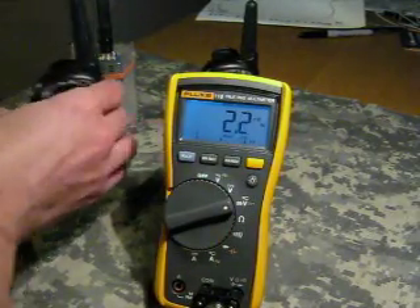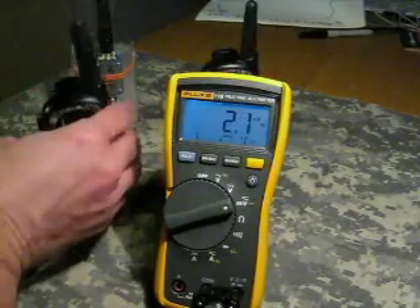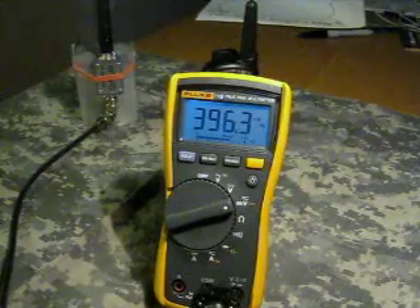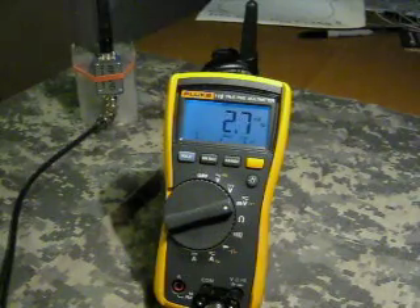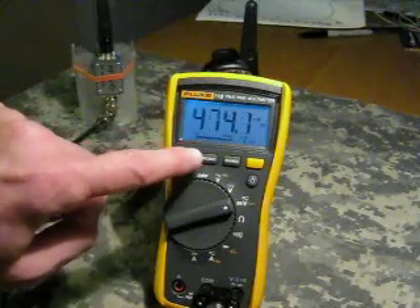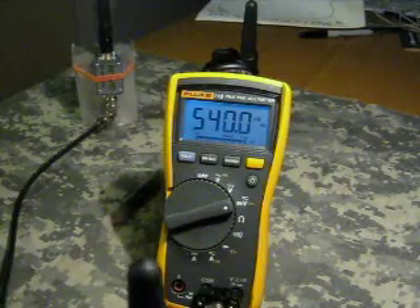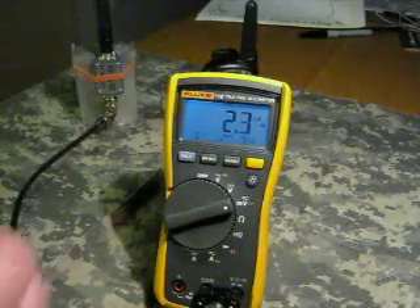We'll just do this a little again to give you a quick show. Basically I'm holding this radio out of view of the camera, transmitting, then going like this, and then going back again. Here we are perfectly polarized — 380 millivolts. I tilt the radio sideways, and bam, down to practically nothing. You can see the little bar graph on here too — the antenna popping up when I'm vertical, and down to nothing. Huge difference, guys.